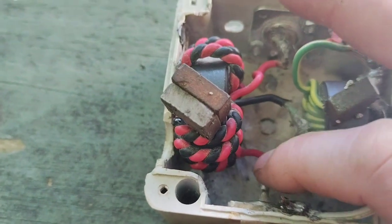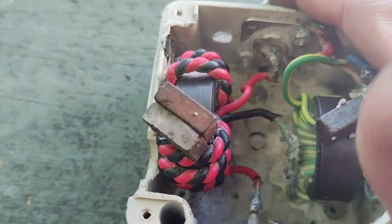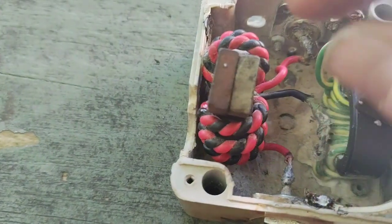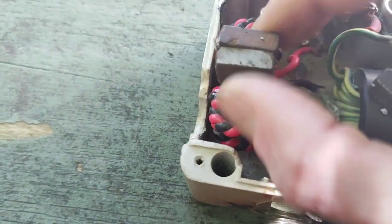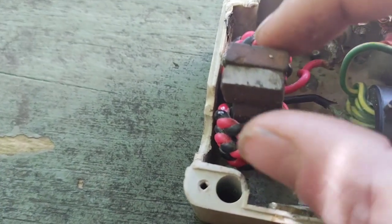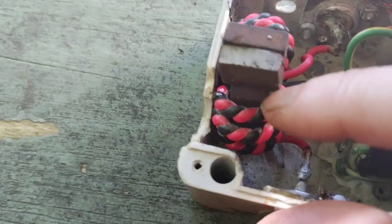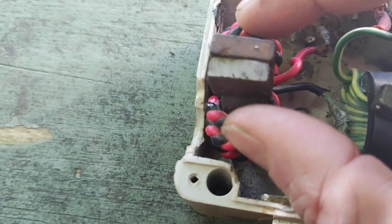The center conductor of the coax from this side does its nine turns and then goes to the center conductor on the output side. The through inductance is varied by the magnet. When the magnet has north and south at the ends in this orientation, the torus field ducts straight through this core, which has reduced the inductance value.